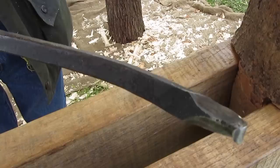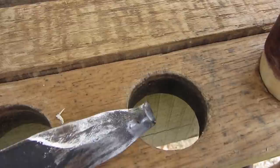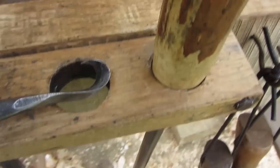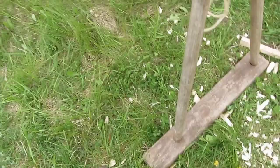All these tools have been handmade, and they've been heat treated and ground round. They really are very effective at taking off nice little chamfers in use. Here's one which is quite a fine tool for making finer cuts. There are also larger ones for making more aggressive cuts. It's very satisfying actually making these tools, and I will get a video up to show the making. The larger tool is ground on both sides so it can cut on both sides. The wooden handles are just very simple sort of stumps.